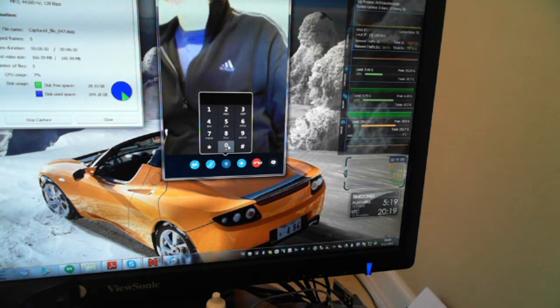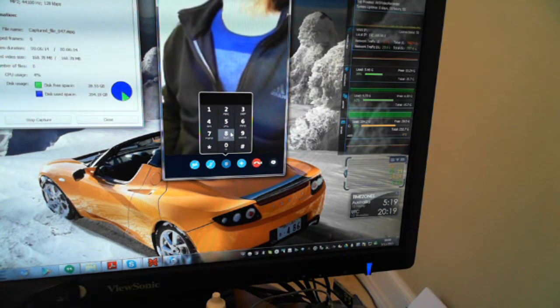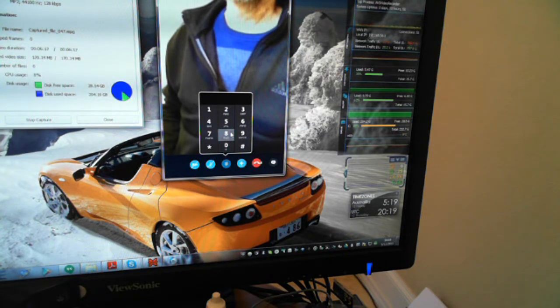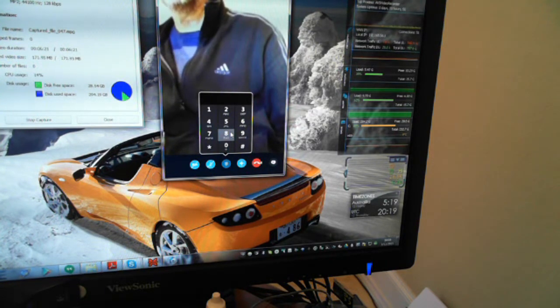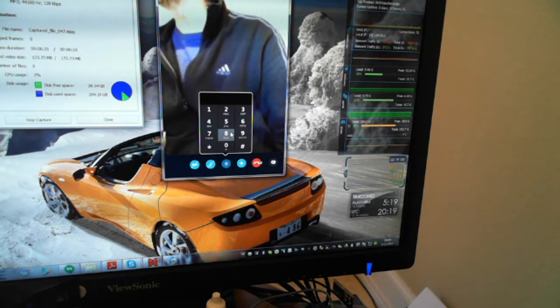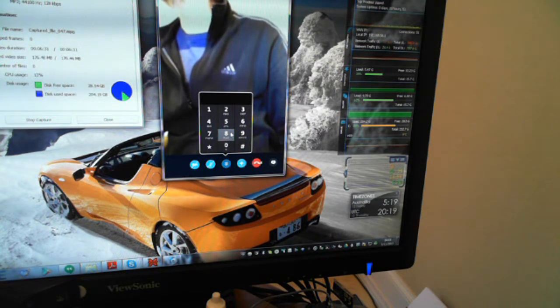And then I now have pulse width modulation set up in this, so you can control the speed of the motors. Right now it's one pulse width modulator, so it's controlling both motors at the same time. If you decide to go with this, then we can get a little fancier and have dual pulse width modulators. You control them independently then.